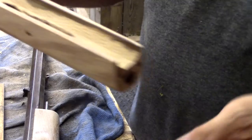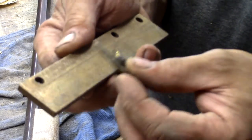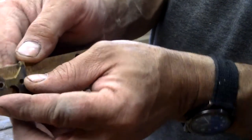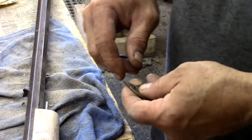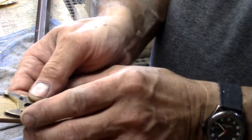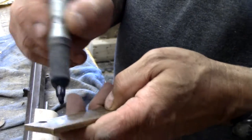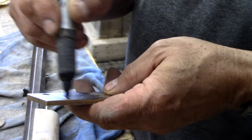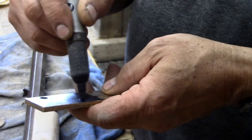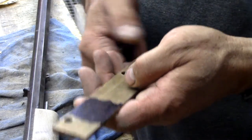We've got a problem with too much gap in the bottom - this piece only comes in there and it's too thin. What I'm going to do is take this piece of brass that I finally found and make a new spacer. It's about double the thickness now, so that's going to work out good - enough thickness to move this forearm piece all the way to the end so the nose cap and everything will line up. What I like to do is use a black Sharpie and mark up the brass. Since I don't have any layout fluid, this is the next best thing. I'm going to go ahead and get this laid out and start making one.